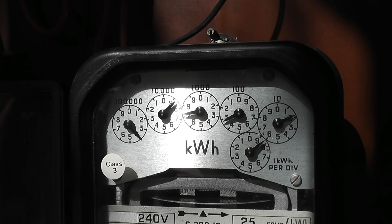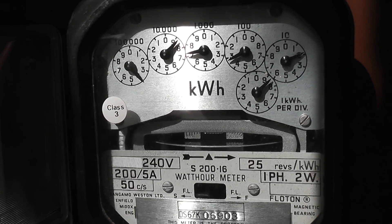I've connected the CT meter on and it's now energized. I'll wait till the dial runs up to 0. It's now sitting at 19 — the last two digits. It's gone up to 0.0 on the top meter and then we'll do 10 units for the accuracy test. Hopefully these meters are pretty close. The potential coils are not separated out, so one meter may record a little bit more, but the principle is there — the proof effect is that the 200 to 5 ampere meter is a direct reading dial.